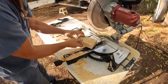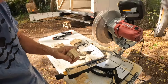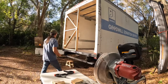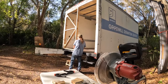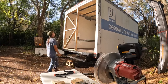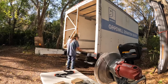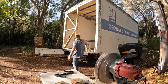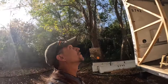Anytime I've built a door from scratch in the past, what I would do is use those shims to suspend the door in its final location, as if it had hinges, which this one didn't have yet. It's a bit of a meticulous process. You would step back, make sure everything is real nice, until you finally got it in place. Then you can add your braces and your hinges. But with the braces already in place, I was having a devil of a time getting the door where I wanted its final position to be.